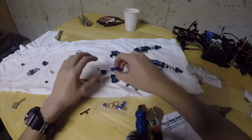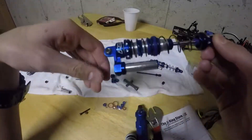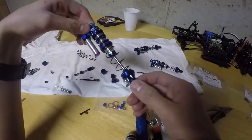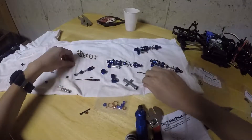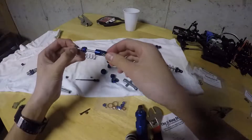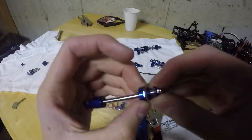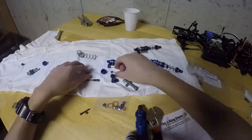Hello everyone. In this video I'll be talking about the problems I've been having with the ProLine Ultra Reservoir Shocks and what I'm going to be doing to fix those problems. To start, the problems with the shocks are that the oil leaks a lot. The main reason for that is — I did some research — the silicone O-rings on the shocks everywhere rip easily.